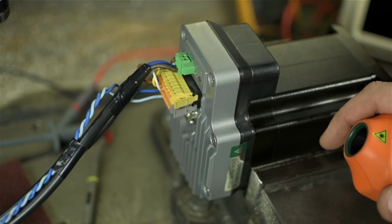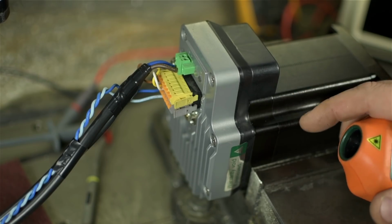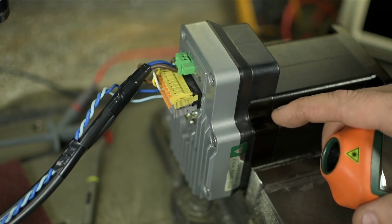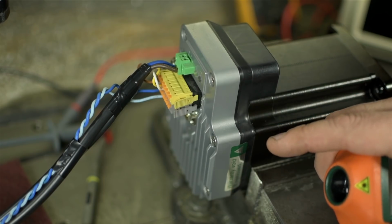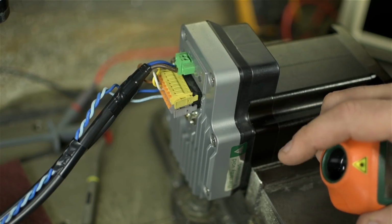Anyway, just an update to let you know it's been sorted. Full steam ahead. And while I wait for materials and parts, I've started screwing around with the encoder feedback. The encoder output is now wired to my smooth stepper motion controller with that nice homemade twisted pair, if I do say so myself. The twisted blue and gray wires, you see.